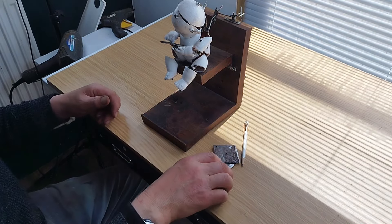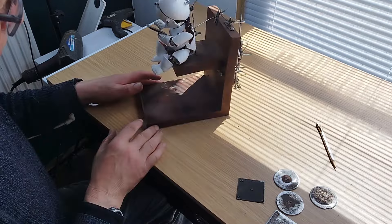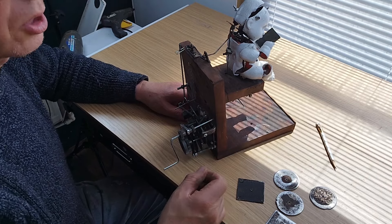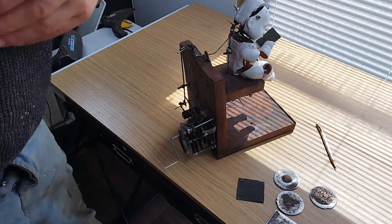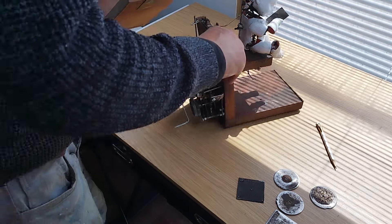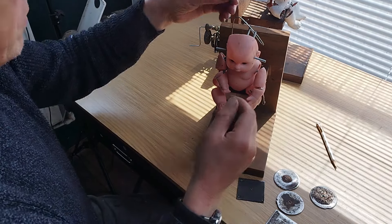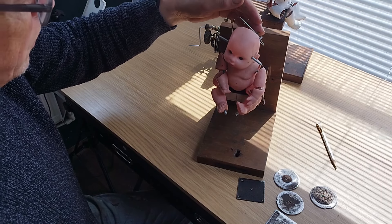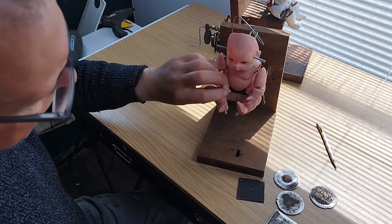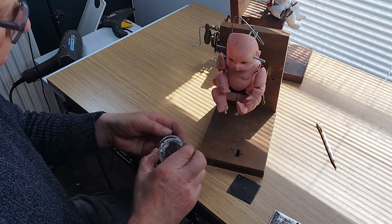What I've built now is the beginnings of the control method. So what we've got here are three discs. I don't think for this new sculpture I'm going to need more than three discs. We've really got three different rates of movement. We need the head to move this way - that's one disc - and also the head to move this way - that's two discs. And then the arm to come up and down, that's one disc. So we've got three control discs that will have dips on them, which will then move levers and bars in the right direction.